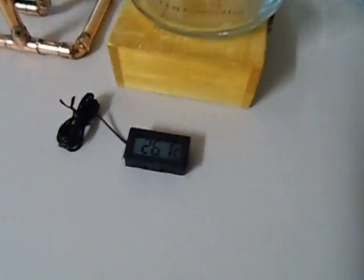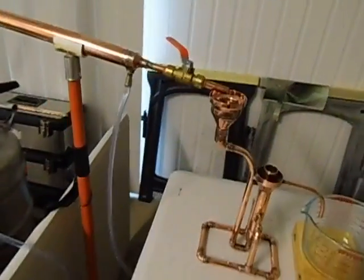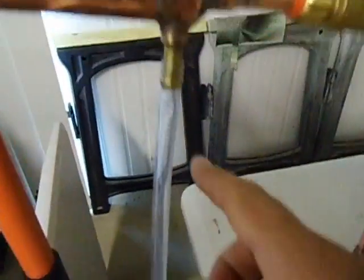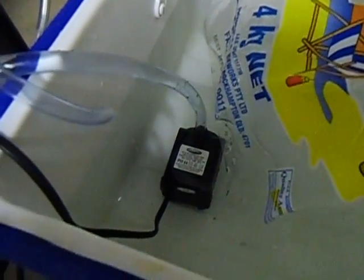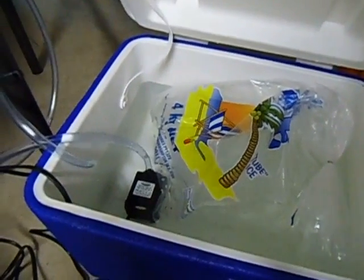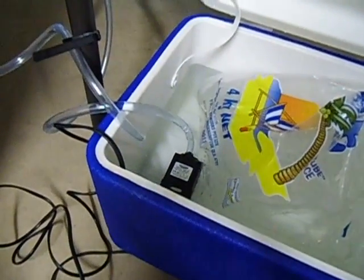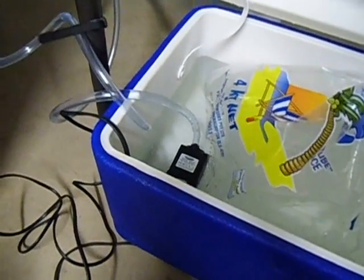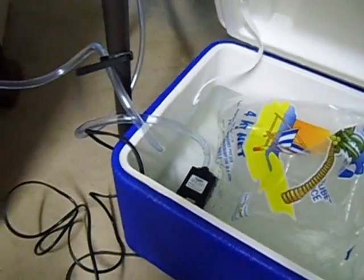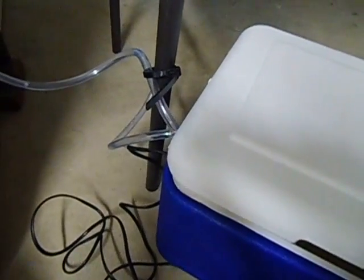This is just to show you that's room temperature inside a garage. That's the water inlet. It runs from a little fountain pump which I've got in an Esky. I've just got a bag of ice. It's a 240 volt submersible fountain pump with an 8mm plastic hose. The water is just to cool and condense the vapor into liquid.